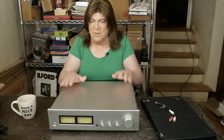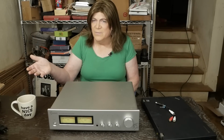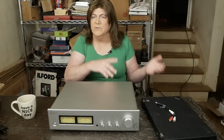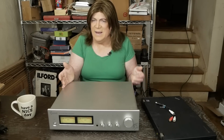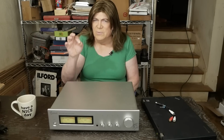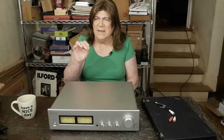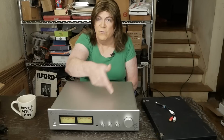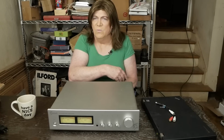And so somebody said to me, Skunky, I'm going to give you this preamp. Would I put it in my system? No. I listened to this thing back and forth between this being in the system and then hooking the cable straight from my phono stage to my 300B amp, and then putting this in the system and pulling it out. And it wasn't like it was night and day. It was a very, very, very subtle difference. But you could just tell there was a little bit of clarity missing. The cymbals just were a little less sharp. And I can believe that because you're running the signal through 2 more tubes, which is 4 triodes. You're running it through 2 more coupling caps before it gets to the amplifier, which aren't necessary.